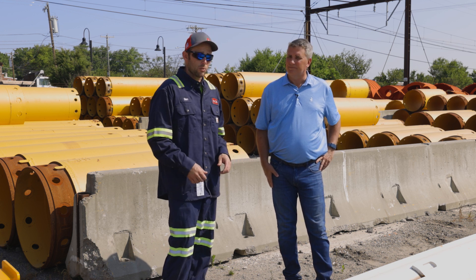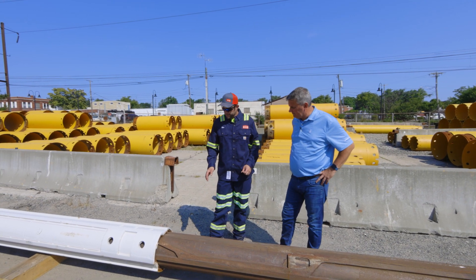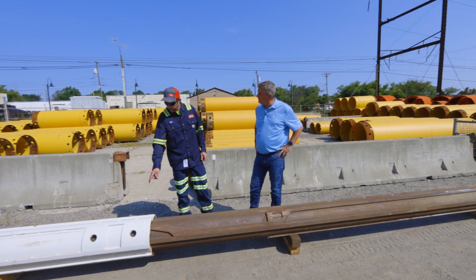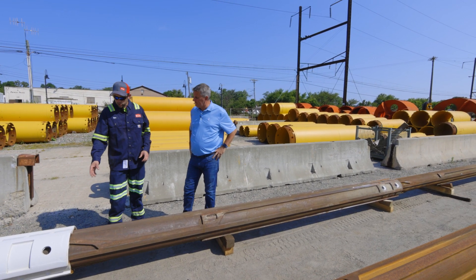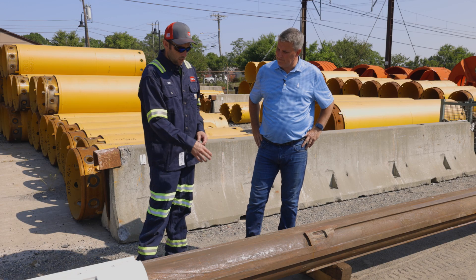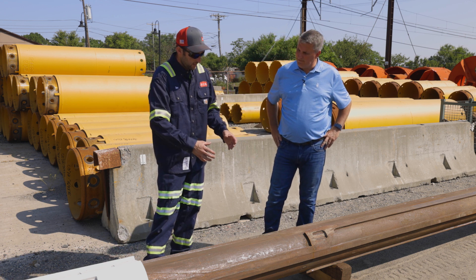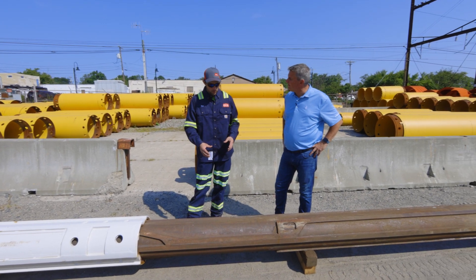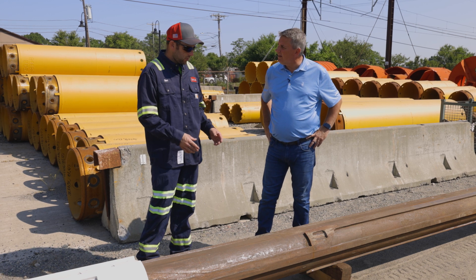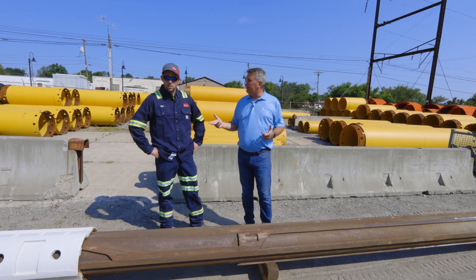Here we are at the second stage — the inner stage. The inner stage is controlled by the drive shells welded in the very bottom of the outer stage. Much like the KDK, the drive shells slide up and down the inner works of the Kelly bar in a neutral position until you'd like to lock. This is the locking area in which the bar would turn in to lock for crowding down and drilling purposes. Once you've finished drilling, you can unlock the bar, put it in the neutral position, and then proceed to telescope back in.